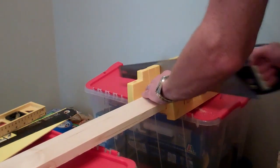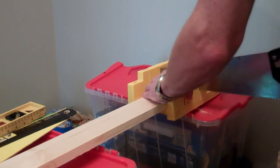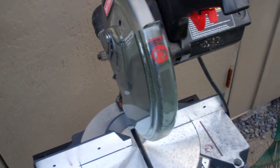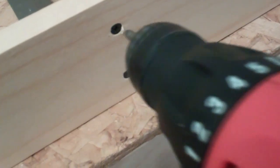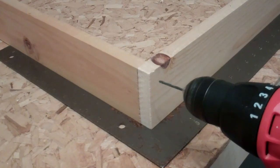Without a workbench I had to improvise. I have no problem using my handsaw and a miter box, although I sure miss choppy. Next I made the frame — I used my big square to make sure the inside supports were perpendicular to the outside frame. Keeping my frame as square as possible will make it easier to attach the ply table tops. I screwed the wood together, and on the ends I pre-drilled to avoid splitting the wood. My benchwork will be 4 feet high, mainly an economical decision because I bought some 8-foot 2x2s and cut them in half.